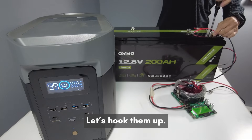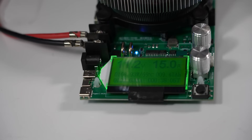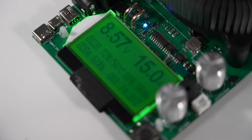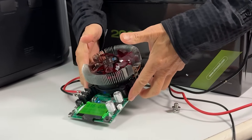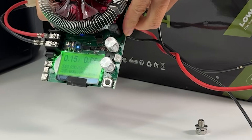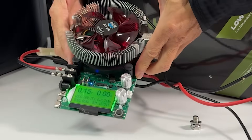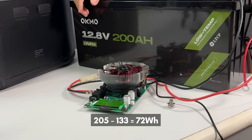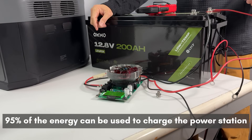Let's hook this up and see how much remaining power is left. I'm surprised it still has 11.8V. We'll let it run and see when it runs out of power. It just falls below 11V at 130 Wh remaining. So the remaining energy may or may not be able to charge the power station even if connected. The battery finally exhausted — we've got 205 Wh left. The Delta II Max can hold 2048 Wh, but since the voltage dropped below 11V at 133 Wh remaining, which is about 5% of 2571 Wh, the usable energy for charging the power station is almost 95%, which is quite impressive.